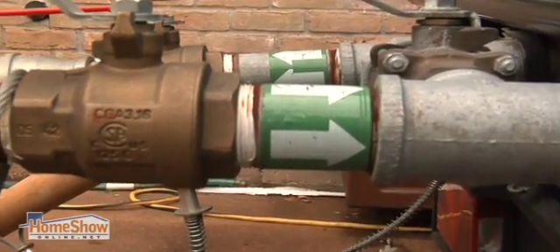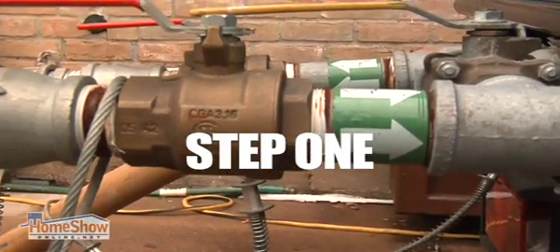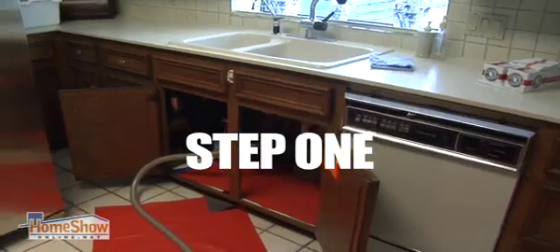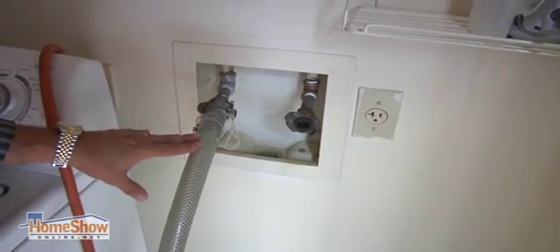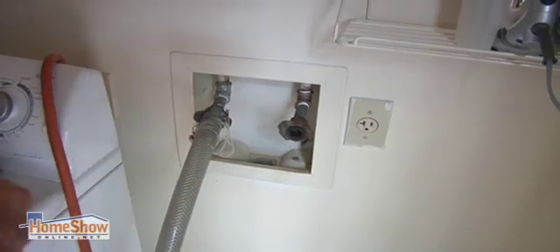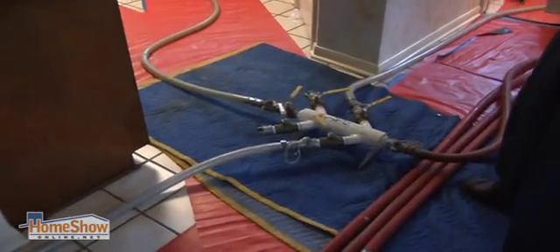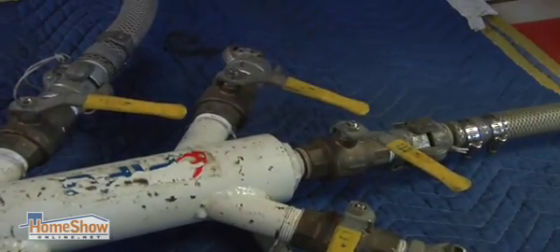The pipe relining process is performed in three steps. First, hoses are attached to all the access points in the house, including toilets, sinks, and showers. We've got an air hose connected right now to the hot side of the washer and that's being dried. If you were to feel this hose, you can feel that it's warm to the touch. By actuating these valves or partially opening or closing them, we're able to control the amount of air that we're introducing.